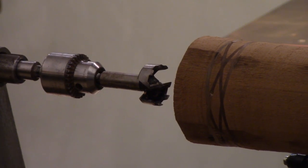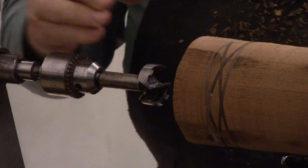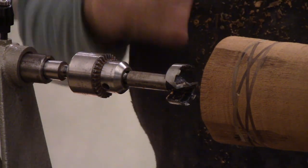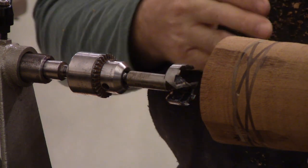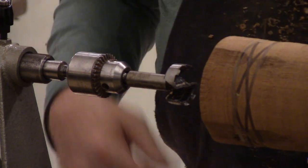What I've been doing is using like three different sizes, drilling a small hole and then a bigger one. Well, I think you should always do that anyway. If you're going bigger than an inch and a half, I would do multiple holes, but I would always mark and cascade the three sizes you're going to use so that as you go out bigger, it stays concentric with the original hole you were drilling.